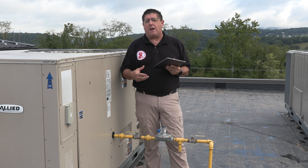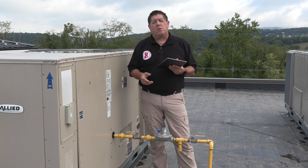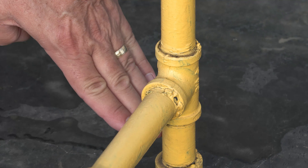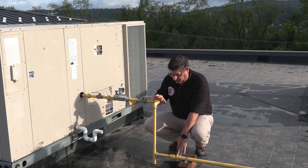Another part of the COMSOP: we should never turn on an appliance that is in a shut-off position. If it is in a shut-off position, you are to note where it's shut off and not inspect it other than visually. There's also a part of the standard that talks about having a convenience outlet within 25 feet of the appliance. In this particular unit, I don't have an outlet — that would be something to discuss and place onto my report. We are also supposed to note if there's any venting coming out within 10 feet of the appliance. We are to report on slope of piping and flue piping, but we do not have to take any testing or diagnosis of proper operation.